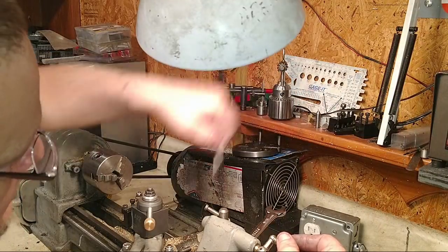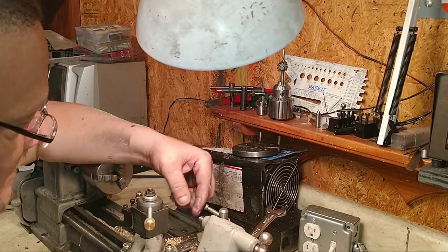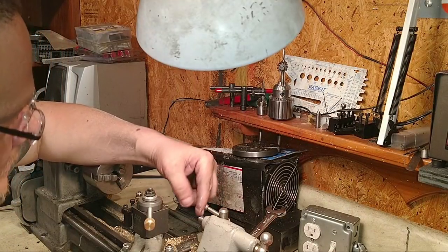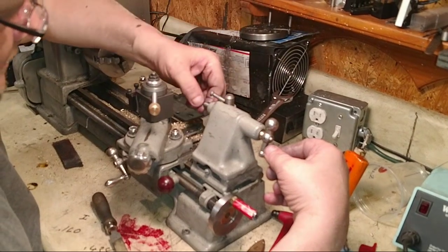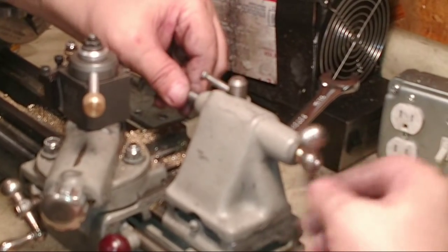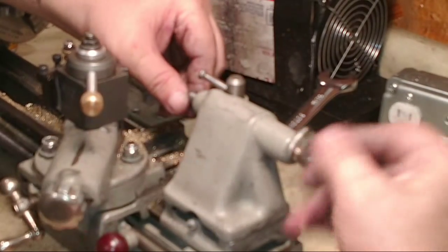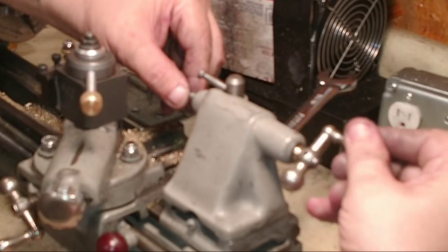My little pointers, whatever. No, now this one, look. That one right there. So that center is just too small. It's been ground back too far. So that's fine. Shorten the taper. See, look, I can come all the way into here with the taper.